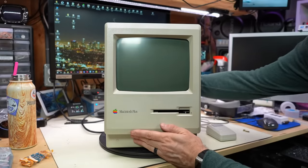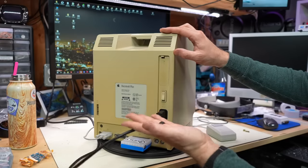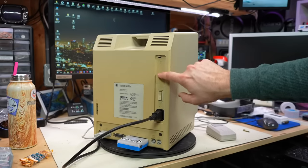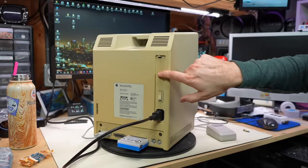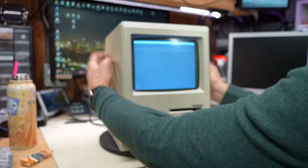I'm using a ceramic adjustment tool from AliExpress to make adjustments to the screen — it's completely non-conductive so there's no worry about sticking it into the adjustment holes. I adjusted the height so it fills the picture better. And the jitter from the other board is definitely not there on this one. All I did was swap the analog board — the deflection yoke and CRT are all shared. The Mac Plus is fully operational. It's all back together, booting cleanly — bumping on it and nothing cuts out.